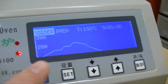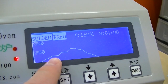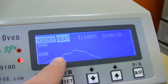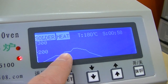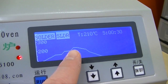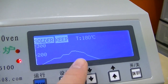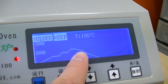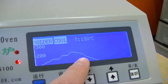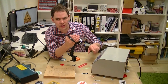The temperature profile is entered here. Press set and scroll through each phase. First, the pre-phase brings all components up to 150 degrees Celsius and holds for one minute. Next, the heating phase holds everything up to 180 degrees so it's ready to solder, holding for 58 seconds. Then the solder phase reaches a peak temperature of 210 degrees and holds for 30 seconds of soldering time. After that, the keep phase lets it naturally cool down to 180, the fan kicks in and force-cools it to 150, and then it continues cooling to room temperature. To start the process, all I have to do is hit the run button — everything else is controlled automatically.